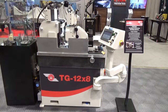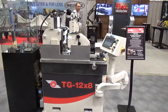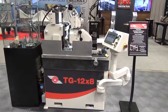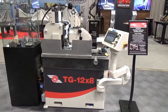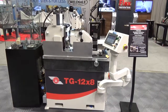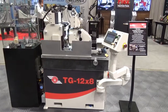We added stepper motors and ball screws to our dressers for programmable traverse rates as standard equipment. With this new platform, wheel dressers are offered as air-sensing, automatic dressing, over-the-wheel CNC, as well as rotary disc diamond CNC platforms. On the TG 12x8, we upgraded our regulating wheel servo drive with a 170 foot-pounds of continuous torque motor with a 10-to-1 gearbox. No matter what your through-feed application is, the TG 12x8 is a perfect machine for grinding it.